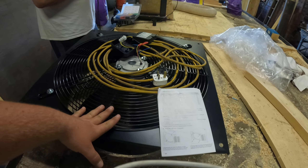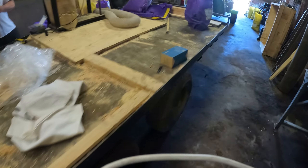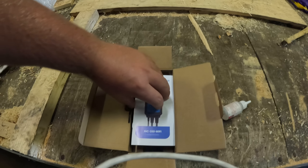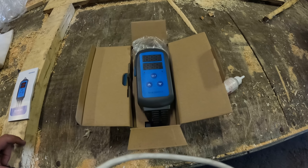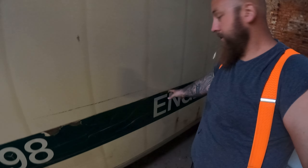So the fan can mount on the inside flush and then this box can be on the outside. Once it's on the outside, it's going to get plugged into an Inkbird plug-and-play humidity controller. I've borrowed the same idea from what Archie uses at Oak Farm Firewood. Basically, you can set your humidity values and it turns the fan on and off once it reaches a certain point, then lowers it down by a 5% differential or so. It's Wi-Fi as well, but I haven't got any Wi-Fi down here yet - I'm going to get one of those mobile broadband things.